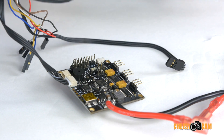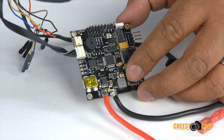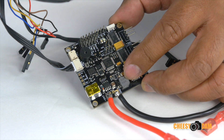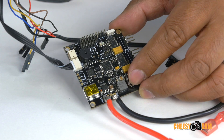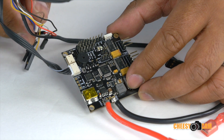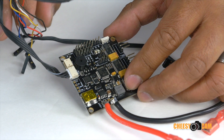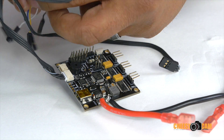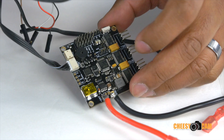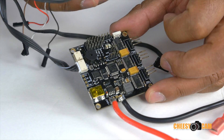Let's take a look here. On the bottom part of the board — it's upside down in the video, but if you look at yours you'll be able to see it. Look very closely — there are some lettering and numbers. The one here is the button. That button is for the joystick: as you press the joystick there's a momentary button inside, and that allows you to switch profiles — click it once, twice, three times, four times.